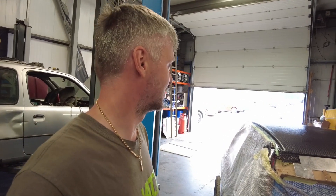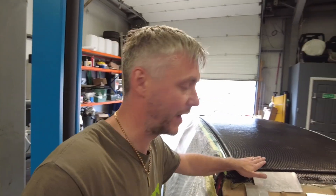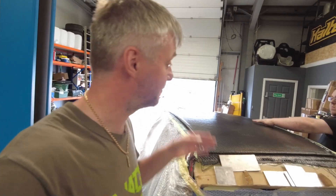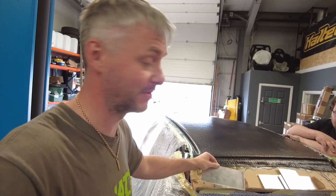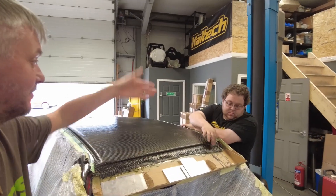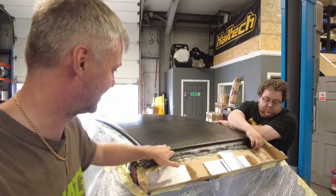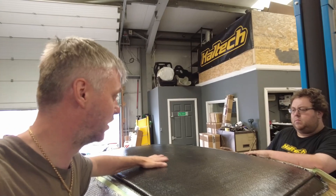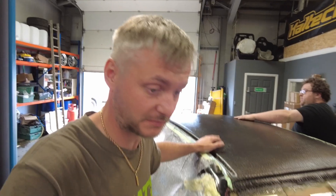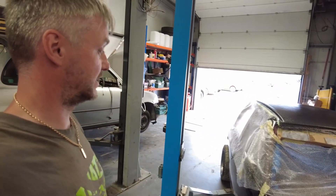Yesterday before I left I was really upset — looked at it and was like, it's ruined. But we managed to wait until the B-stage, which is about four hours until the resin is really, really sticky. Then we managed to use those clamps and — you've probably seen it on the time-lapse — press it and put some weight on it, so at least the front corner has a nice straight edge. Overall, it's a race car. We know it's going to be light, and at race cars you need to look from about a meter and a half — from here, it's mint.